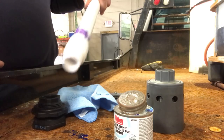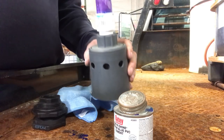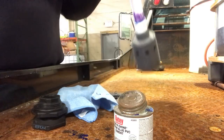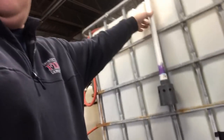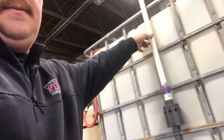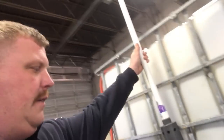So once we got that done, that will screw on to the pipe there like so. And then glue this one on right here. Now we can put that right wherever we're going to put it in our tank — it's going to go through the bulkhead fitting, screw it on there, and then that will mount into the top of the tank and put us wherever we want to be when we get it cut. I made this one long because I didn't want to cut my pipe.